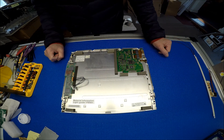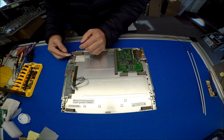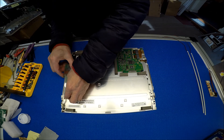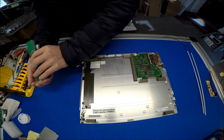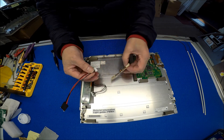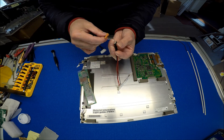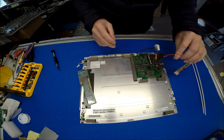Right now we need to remove the inverters, and then we'll install our LED backlight back to the same locations. First we disconnect the CCFL lamp, then remove the inverters. There's only one screw holding the inverter, and there's a plastic clip you need to move out. Here's how the connection is — this is connected here, and this one is connected here. Set it aside.